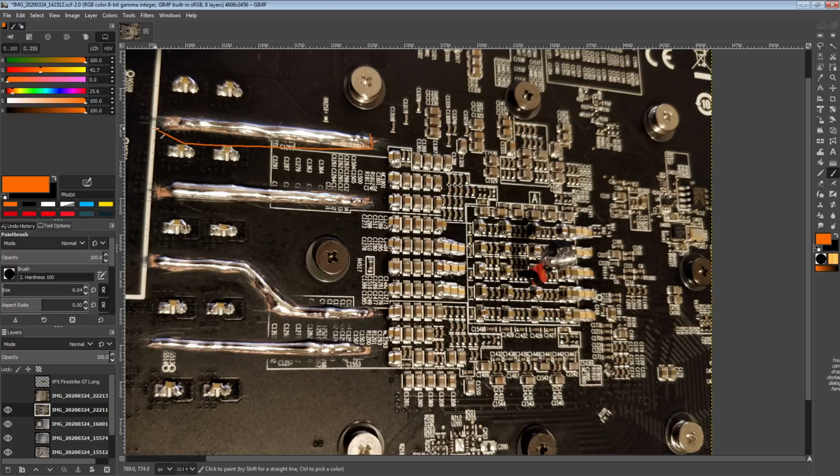This is actually something you might see on server PCBs occasionally, and some OEM PCBs as well. Dell, HP, Lenovo will sometimes have VRMs where you'll see basically solder strips going across the power plane. The reason this is done is, one, the solder mask actually acts as a thermal insulator, compared to, say, just bare metal like tin here. You can basically lower the temperature of the power plane, which is connected to the VRM, so you can lower the temperature of the VRM indirectly. This will act as a bit of a heatsink for that. The other thing this does is it increases the cross-section of the power plane, so you get more current handling capability.